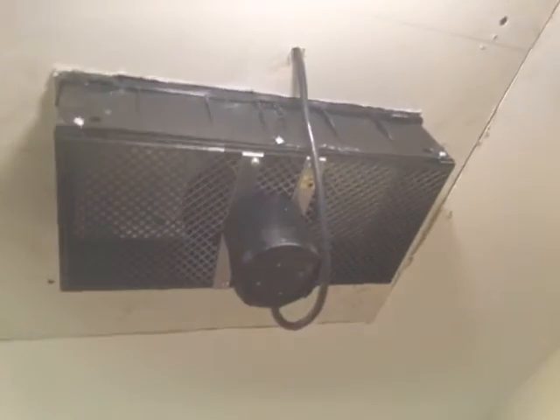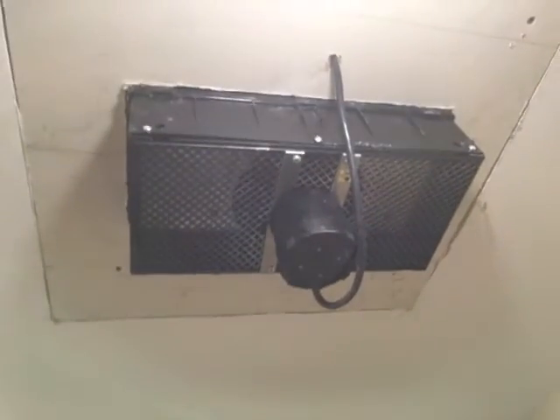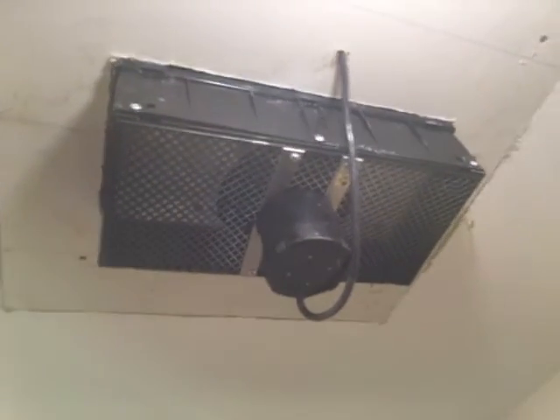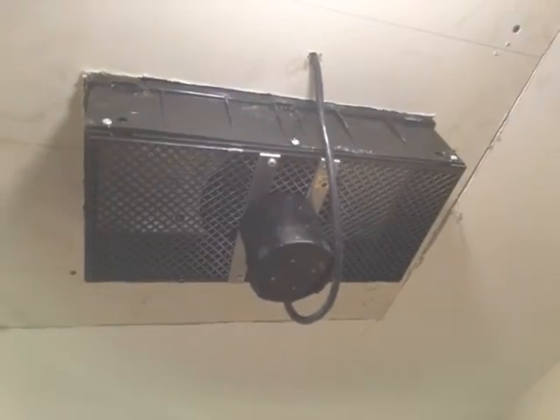You can see that the motor is enclosed. I could get a regular bath ventilation fan, but the motor on those is not enclosed, and that's a spark risk I didn't want to take. So I chose a ventilation fan with an enclosed motor.